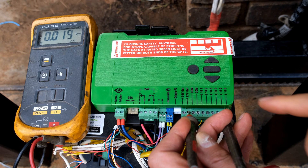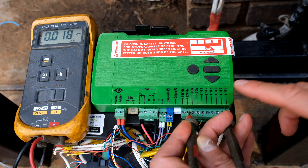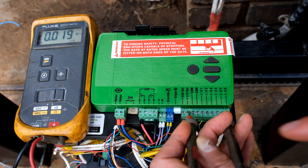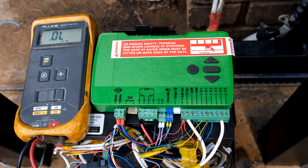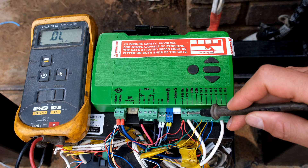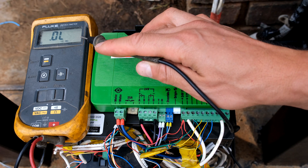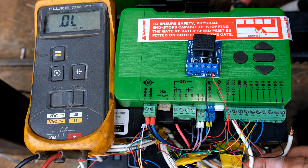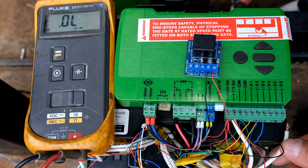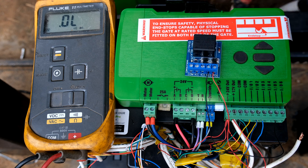What happened is the 12 volts was allowed to flow into IO5 because IO5 went to ground, meaning current flowed from that terminal. I've got wires here connected to a siren - that is the noise you heard. The positive of the siren is connected here and the negative of the siren is connected here, and that is why I measured close to 12 volts. If you connect a relay board you can then use that as a trigger for your alarm or a pulse.